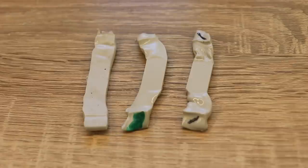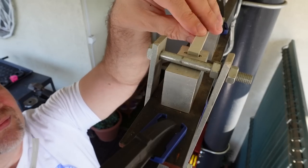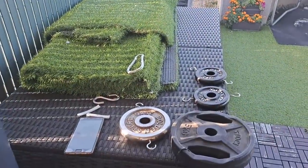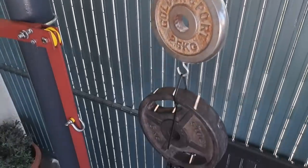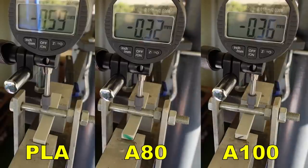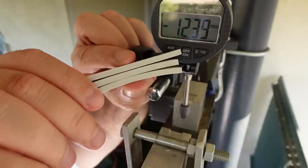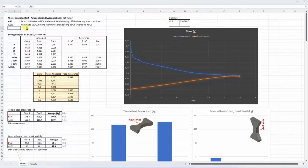Now the 3-point bending test. I can see a lot of warping and deformation on these test objects. The distance between supports is 15 mm. Here you can see my equipment and I will use these loads, which I place one by one. Here you can see all loads placed at the end of one test, side by side: under 1.25 kg load, 2.5 kg load, 5 kg, and under 10 kg. After testing, I think very minimal deformation.